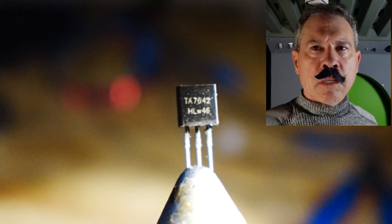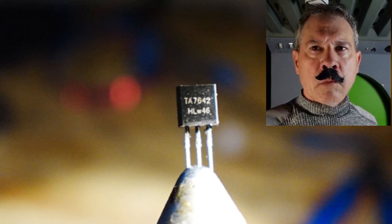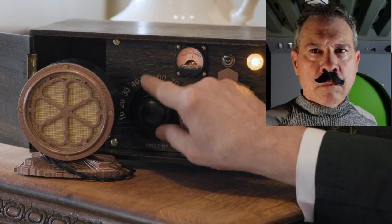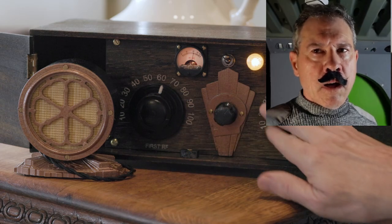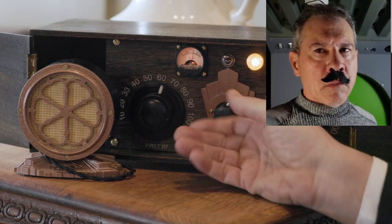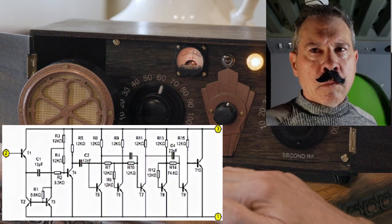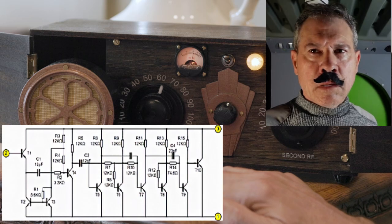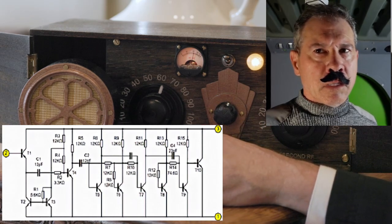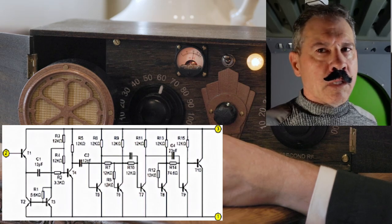Try the TA7642 IC. It is the great-grandson of the Ferranti ZN414 from the early 70s. It works as a tuned radio frequency radio, a TRF. It is actually an integrated circuit that looks like a TO92 transistor. Yes, with only 3 leads: ground, in, and out. The output lead also has the power. It has a detector, an AGC circuit, and is made up of 10 transistors.